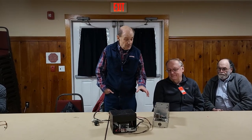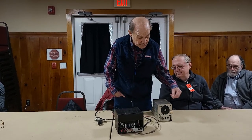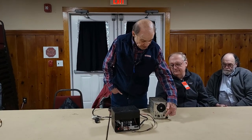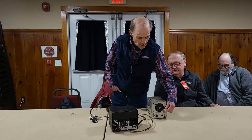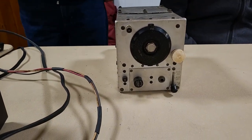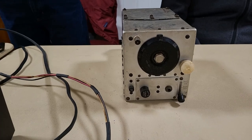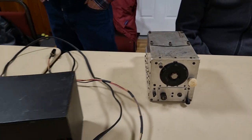The standard conversion on any of the ARC-5s for ham use: rewire the filaments for 12 volts, bring the audio jack out to the front, put a volume control in, and then have some kind of operation knob to turn the tuning. It's a spline drive that can't be found, and there are tricks for adapting to it — one of them just failed on another ARC-5, so I'm back to the planning board on that.